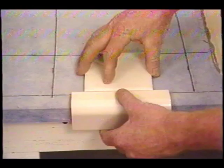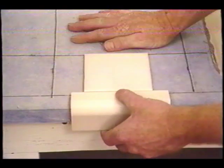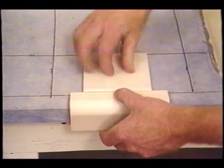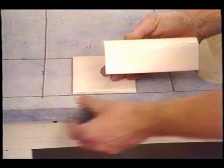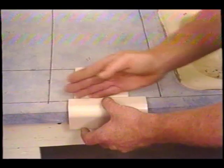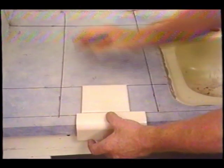Now, to back up a bit, the most important part of the countertop layout is the relationship between the factory edge of a full piece of field tile against the V-cap tile, which trims off the front edge. The rest of the layout proceeds towards the rear from this point.